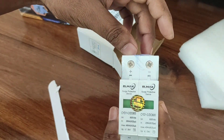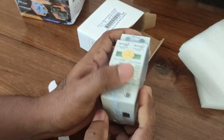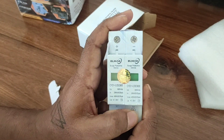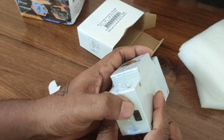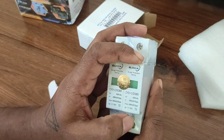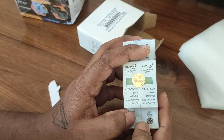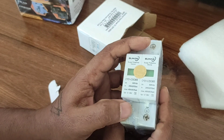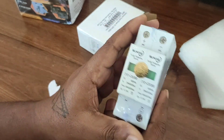I'm going to install this SPD to my DB, and I'll take a separate grounding for this connection, because high voltage will be delivered through this earthing pin. You need to do a separate earthing — don't integrate it with normal earthing, because this may lead to damage to any other electronic components or devices attached to that earth.